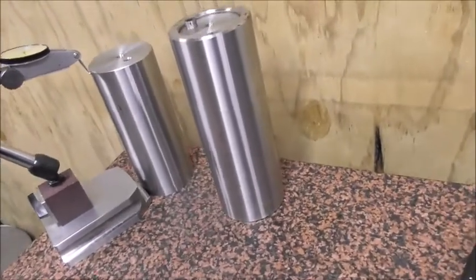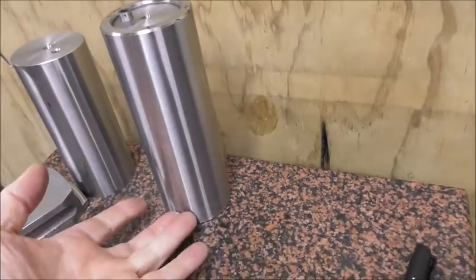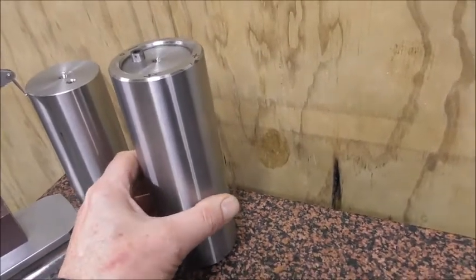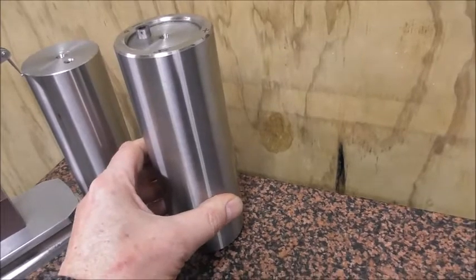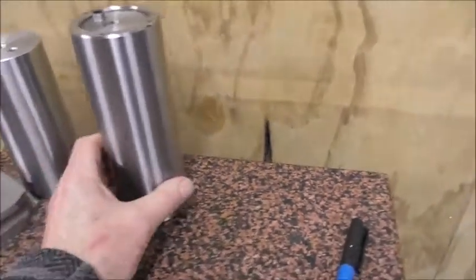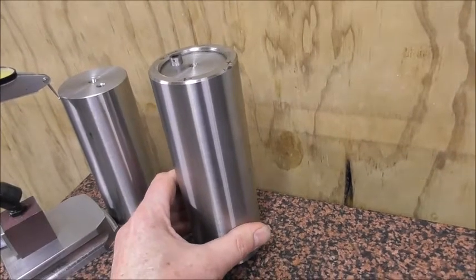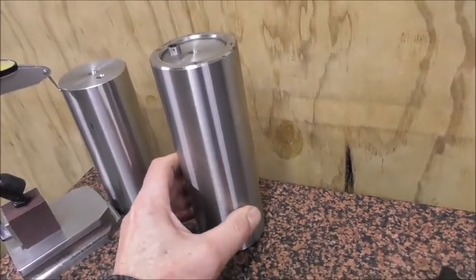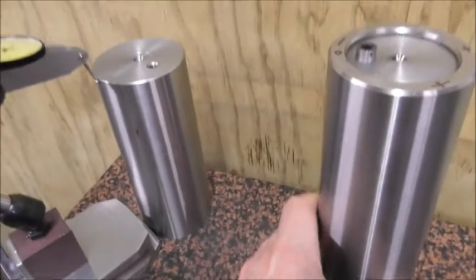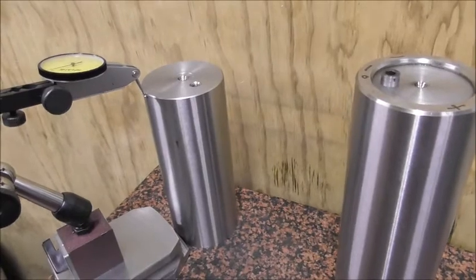Just to summarize: I made this cylinder square, cylindrically ground it, kissed the end, then started setting it up and found I was getting variable measurements. I ultimately tracked it down to slight out-of-roundness and out-of-parallelness, concluding it was probably due to a fault with the heat treatment or stresses in the part being relaxed during grinding. It would never make a decent square, so I started again and made a fresh cylinder square from a new piece of 1045 steel.